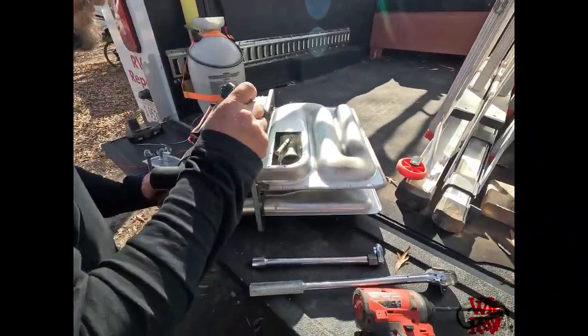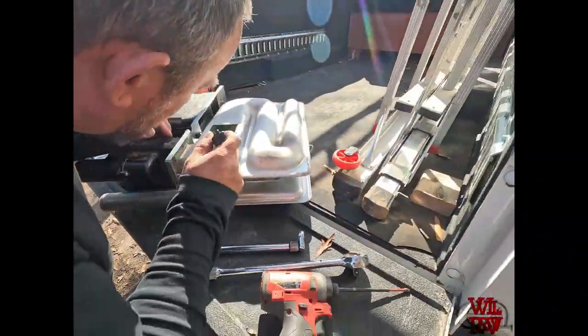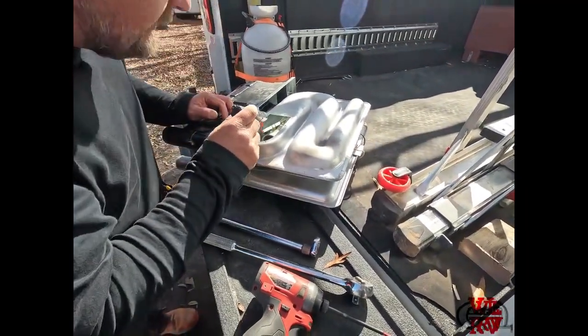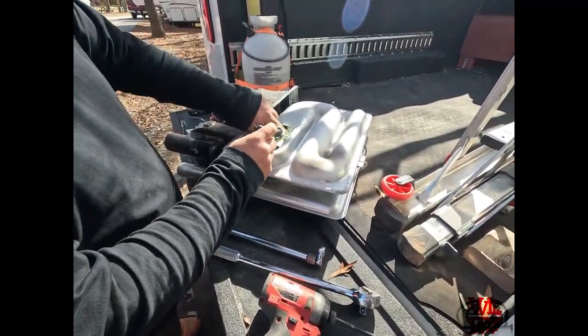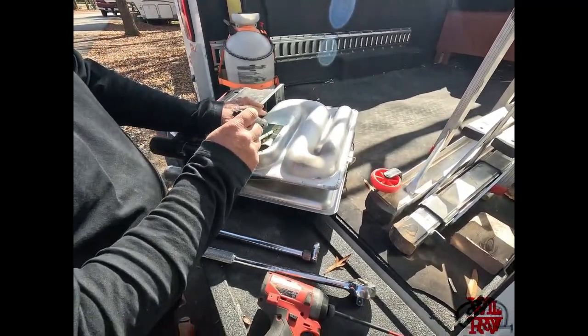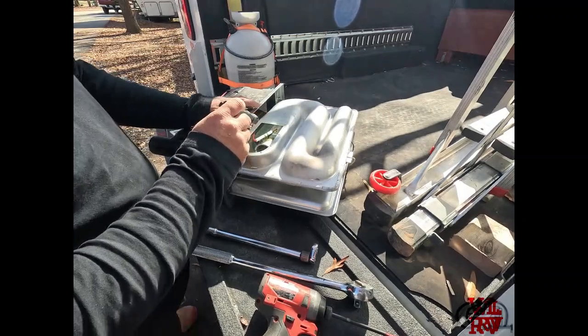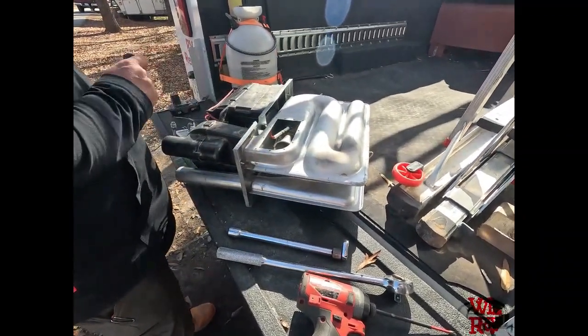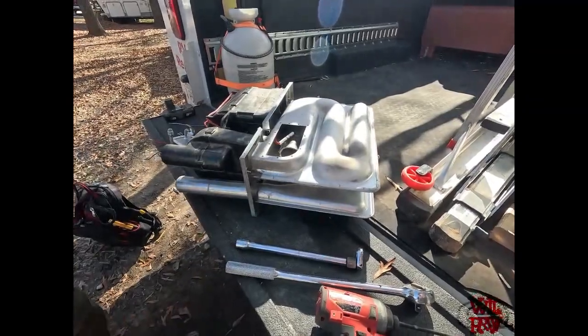Where's the actual igniter? Is that it right there? Yep. Does it just get red hot, like a glow plug? No, it ticks. It does a spark across that gap. Oh, okay. Arcs to the burner head, yeah. Okay. Is there a way to test that? Or is the click we're hearing adequate? Right. Yeah. Hearing that click with the spark.